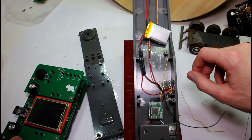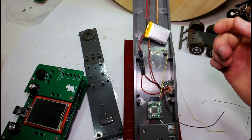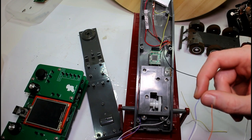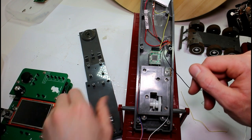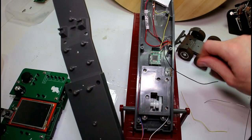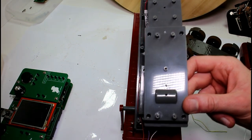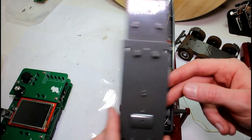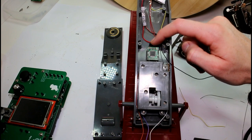Our wiring is working perfectly — the switch powered it up, the control board was able to control the motor, and everything's working fine. I've added an extra wire for ground for the lights, plus three wires: one for the left indicator, one for the right indicator, and one for the brake lights. The wires run through a rotating wheel section so it's a little tricky — I need to figure out how to wire it through without making it impossible to disassemble.